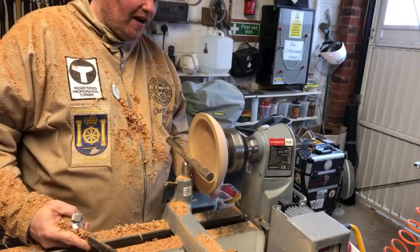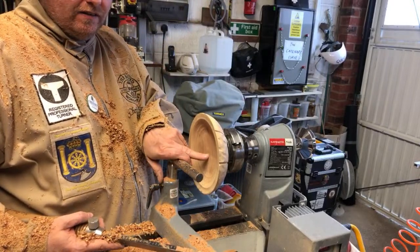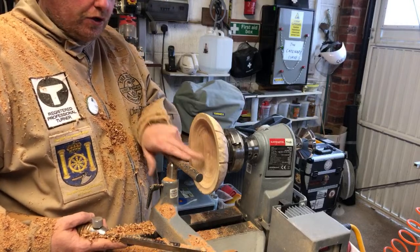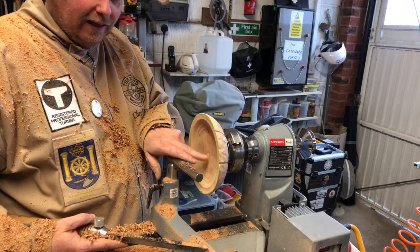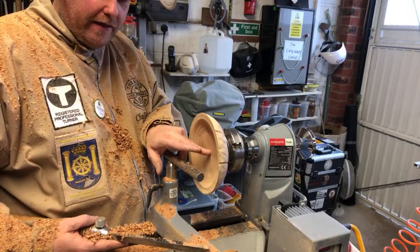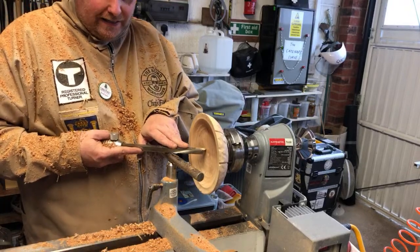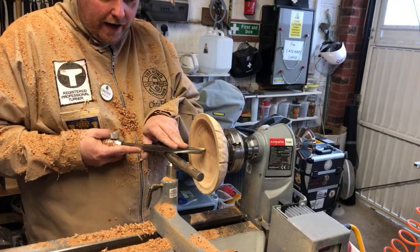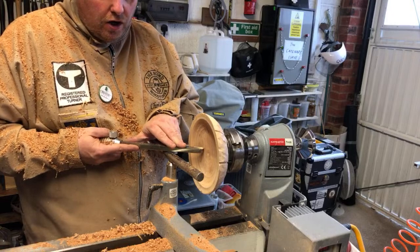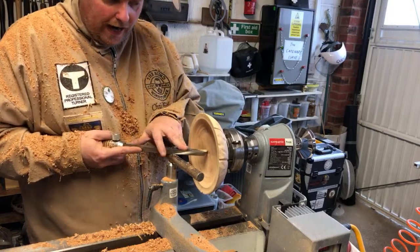And obviously, I know that a lot of you guys put a hole in the centre to go to your depth and you're removing that very slow spinning centre portion. I don't do that because that little pip, that little nub that appears is a reference point for me that I feel on the tip of my tool, because if I had a hole there and I overshot, I could get a catch, or at the very least go on to the wrong side of rotation. So I leave that